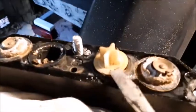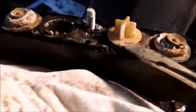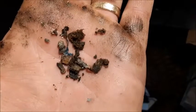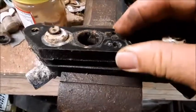There's what she looks like. This bypass, which is one of those spring-loaded bypasses, actually has some crud stuck right there in the side of it. We're going to use a screwdriver to see if we can pry this thing out of the hole. There we go — look at all that mess there. That was causing this thing not to be able to release the pressure off that water pump. This is some of the trash that came out of the water bypasses when we pulled them out. Let's go ahead and separate this plastic part off of the housing.